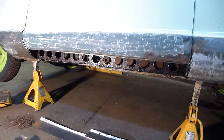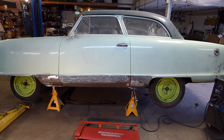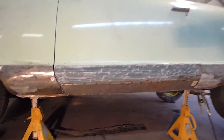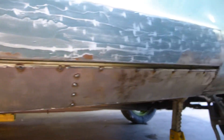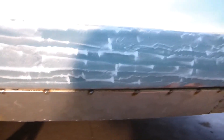I know I said the last segment was going to be the last, but I just had to finish this up. It's actually the morning after — last night I was tired and one of my knees was hurting from bending over working on a car on jacks. I'm spoiled — I'm usually working on the lift — but I needed clearance to get at this rocker. You can see I've got it all tack welded on there. It's not beautiful, just tacked into place. It's kind of flat and I'm trying to contour it to match the rounded shape.